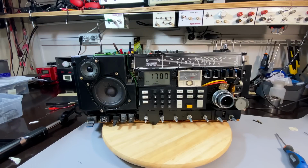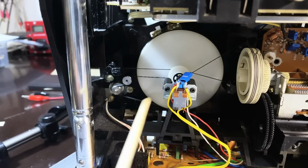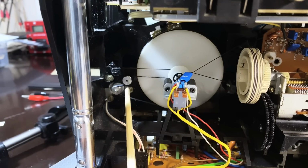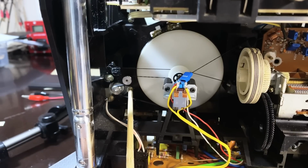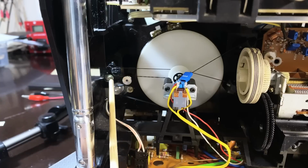I am so happy with this, you will not believe. But there's another little trick I want to tell you about. And that's got to do with these 3 screws that actually hold on the motor. What I found was this was still slipping a little bit, very little when I first put it on. And then I realized that you can actually shift the motor a few millimeters to the left. And I loosened these screws.